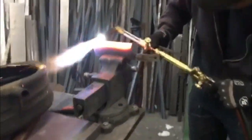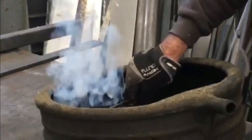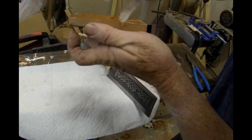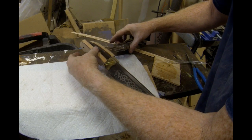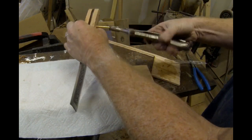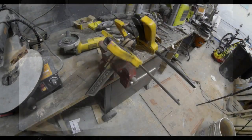It gets polished a few times during this process, but it's just a quick rub with the 500 grit emery paper. I'm not very sophisticated with my heat treating — I brought it to my friend Jason's shop and with a set of torches he heated it up until it was cherry red and non-magnetic, then quenched it in oil. We only heat treated the actual blade of the cleaver; we really wanted the spine to have a little bit of flexibility and not be brittle. After heat treating, polishing, and tempering, I added cherry wood scales — standard knife scales attached with two 1/4" brass pins and a two-part epoxy. The pins are lubed up with epoxy, everything gets clamped tightly together and left overnight.